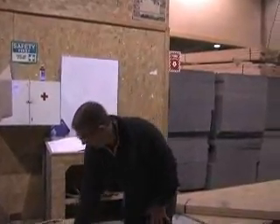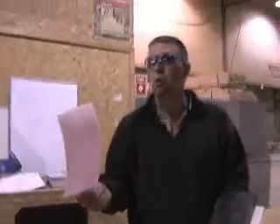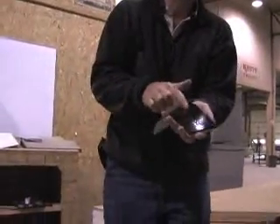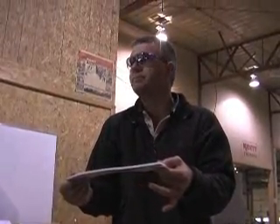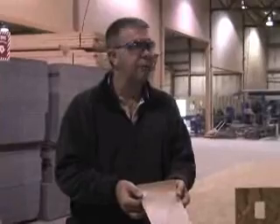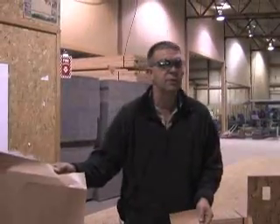That's when not only are we using a lot of panel masking, but we start using things like sill seal — just simple low-grade sill seal, which works beautifully. If we want to go a little further, that's when we go with a premium-grade sill seal. This material has a release paper, so it's got a sticky back to it. When we lay that on top of a gable wall, we know it's not coming off. It comes pretty thick, so once you put it on a flat or butt joint in the field of your roof, just peel it back three inches to either side and you're sealed up. It also comes in 12 and 16 inch.